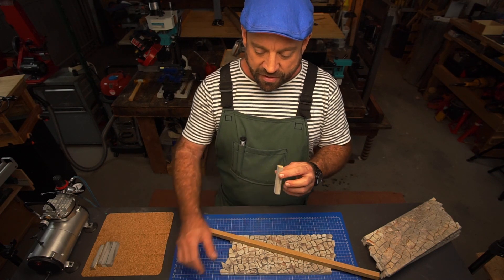What I think we'll do is take these flexible strips and mount them down to the board in front of the set, and fix them with some anchor points that basically hold the curve. Then this piece of wood, once we get it in the right profile and fixed in place, we'll be able to run our form along the edge to give us that perfect profile of the curb stone.